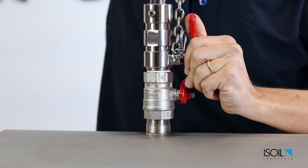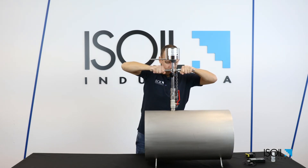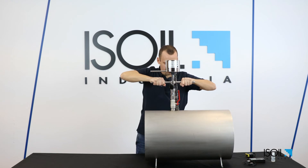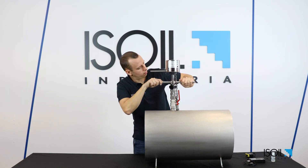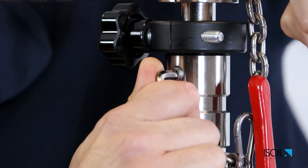Slowly open the valve, holding the meter firmly. Push the sensor down until the reference ring touches the sensor jacket. Verify the meter is still aligned, then tighten the two screws to fix the meter while holding the sensor in position.